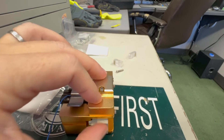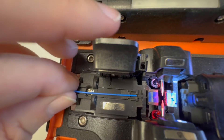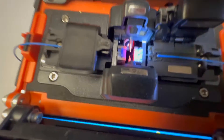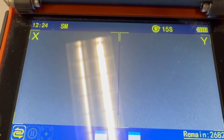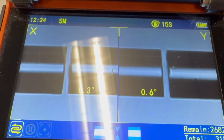After it's cleaved, you simply place it inside the Fusion Splicing Machine, lining it up with the length indicators on the inside, and then locking your fiber down. You repeat the process with the other end, and the machine will do the rest. Do you see how fast that went? Congratulations, now you're an expert too.